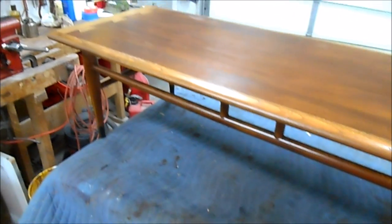Let's turn this piece over and take a look at the underside — you can see indications where it had been refinished. The serial number reads 031266, so this is from March 12th, 1966. This actually came with the two cocktail tables, but clearly they weren't manufactured together — it's a marriage. But they fit. There's also a big scratch across here, dents — all stuff we'll deal with as we refinish it.